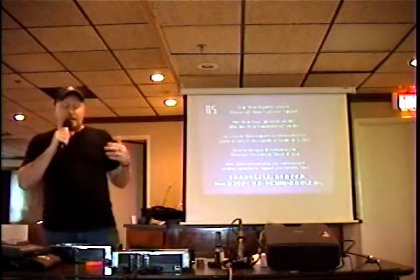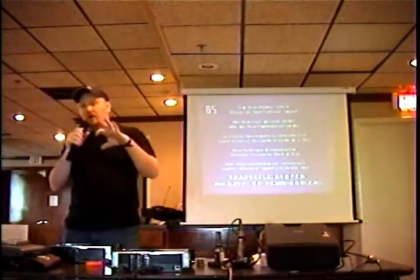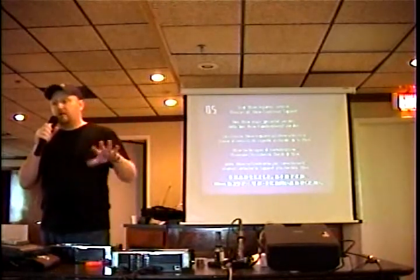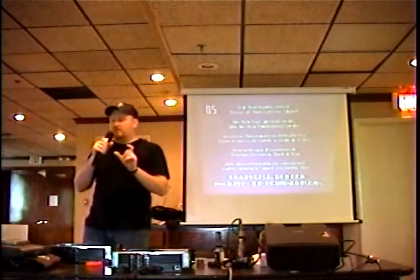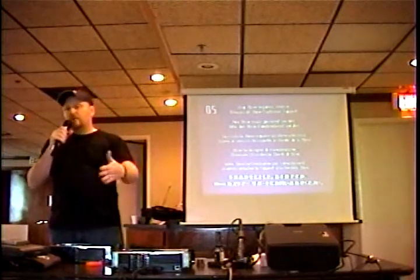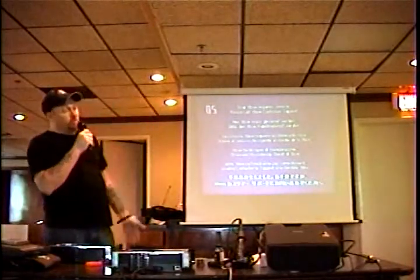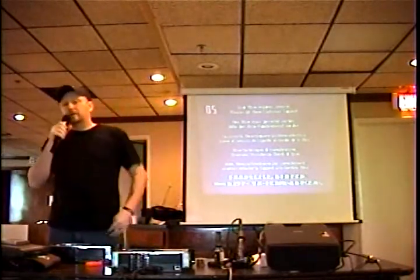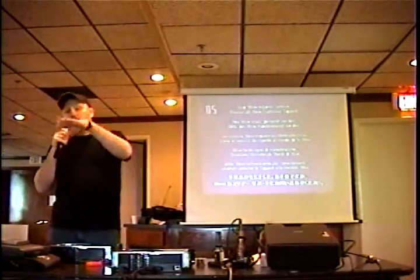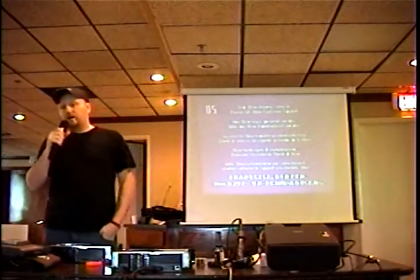Now, the mod chips had a nice feature where they came with switches already. You basically plugged the switch into the mod chip, ran the wire out the back, and mounted the switch, so you could switch from a retail BIOS to a non-retail BIOS. Some of them have even larger BIOSes, like 2 meg, and multiple switches. So you can preload several different BIOSes to do several different things, like a retail one, and maybe you want a blue X on one and a red X on the other. Or you might want to load one dashboard from a partition with this switch, but load a different BIOS and a different dashboard from a different partition with that switch. In that case, you'd want to have a mod chip.